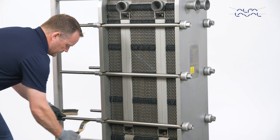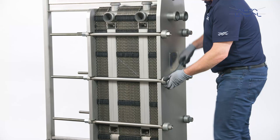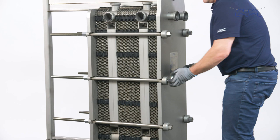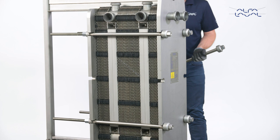There are four main tightening bolts on smaller units, which are equipped with a bearing box. All other bolts are referred to as locking bolts. Start by loosening the locking bolts in the middle of the plates. Smaller units will have locking bolts at the top and bottom — these should be loosened and removed. Next, loosen the four tightening bolts equipped with bearing boxes.